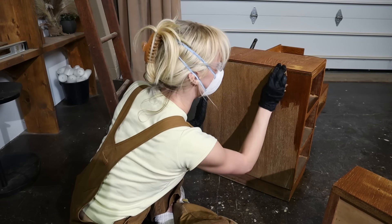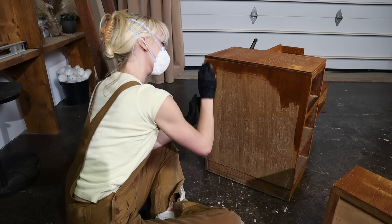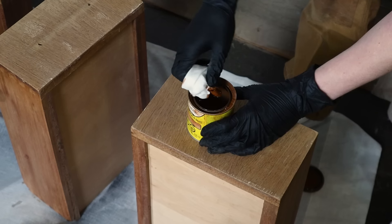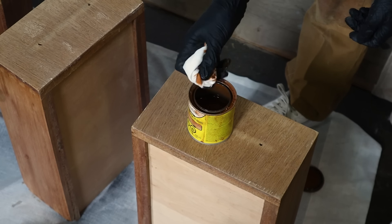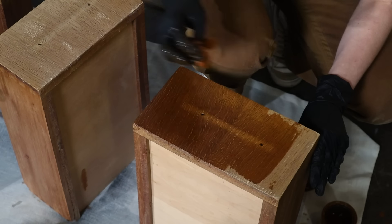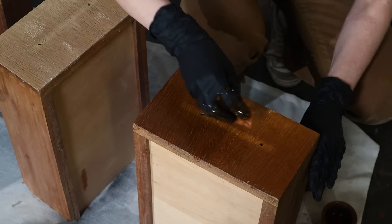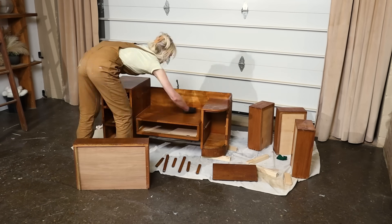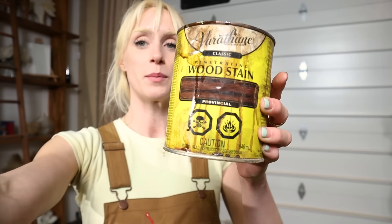When you are using mineral spirits, it's best to protect your hands, make sure you're not breathing in any fumes, and just go in with a lint-free rag. Because it's the bottom of the can, it's going to be really potent in color — I don't know if that's going to be a good thing or a bad thing. Ipswich pine — we're going to do the Ipswich pine, if I'm saying that correctly. I'm noticing some areas were more sanded than others, so the variation in color isn't exactly what I want. But I think if I go over it with some provincial I can kind of even those spots out, so I'm going to do that off camera. And I'm so excited to put this thing together tomorrow.